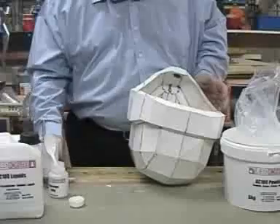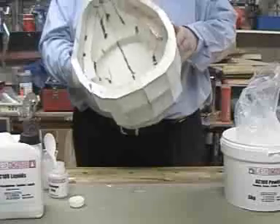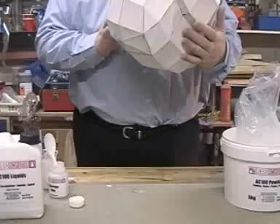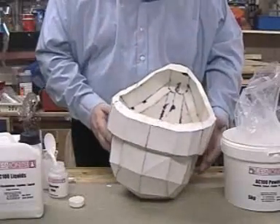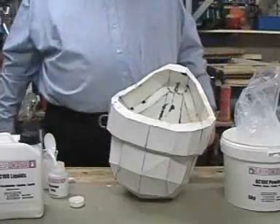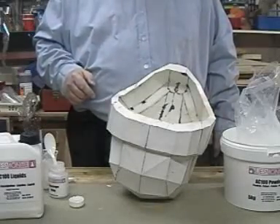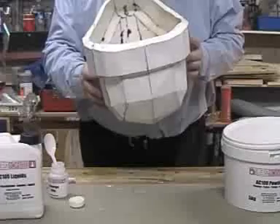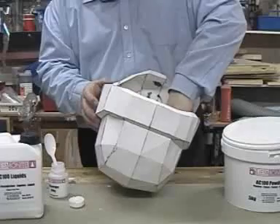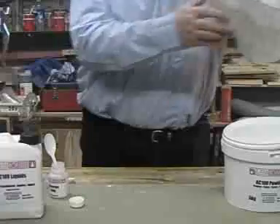That's all of it — it's got probably 50% of the helmet done. I'm just checking it for shape. So we'll go away and see how long this stuff takes to cure, then do another mix for the inside to complete that, and come back with the fibreglass. I went and had lunch and it looks like it's gone into its first set. It's still a little bit damp, so I presume it's got more to go. So we'll do another mix.